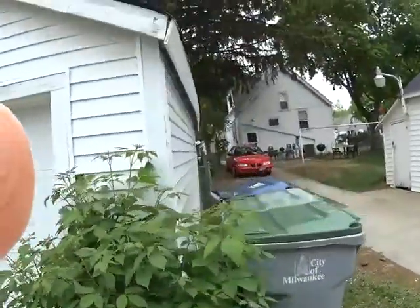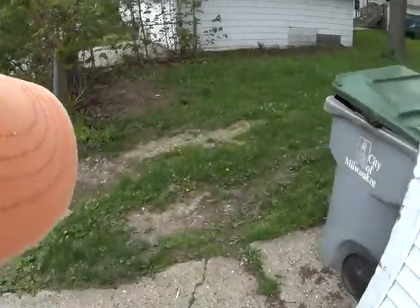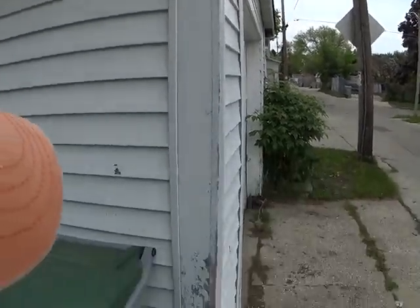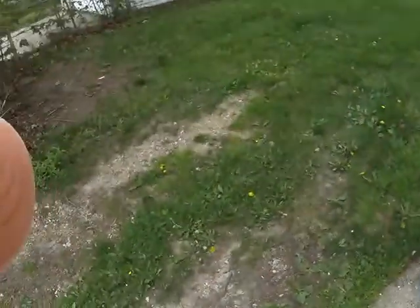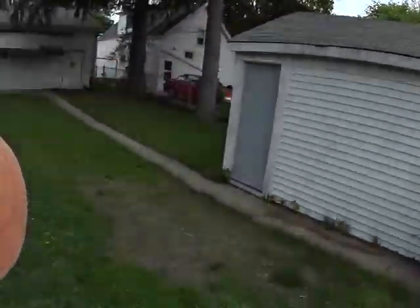Let's see how plumb this is. This is bowing — there's definitely bowing happening. That bowing is probably because of the sag. There's a lot of weight on the outside of the structure. That's also bowing, but everything feels plumb — things are just bowing out. The framework is bowing because of the roof. That would have to be repaired some way.